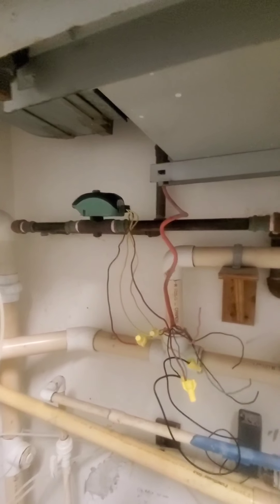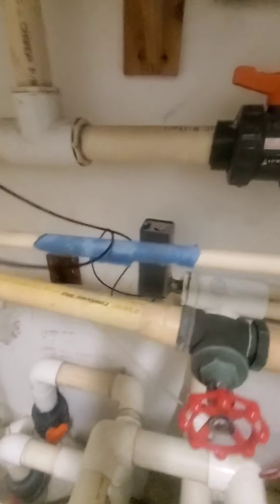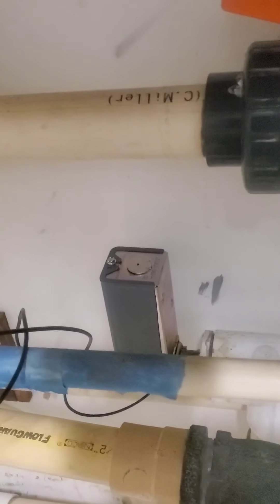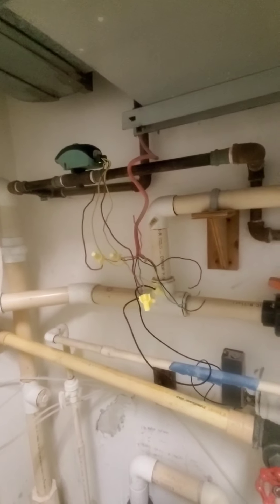So that's what these boneheads did on both of these — they messed that up and blew up that zone valve, which is expensive. But that does the same thing. There's the Aquastat that controls the temperature, that's set to 104. Runs through that zone valve, switch makes, and heads all the way down to the pool or to the mechanical room.